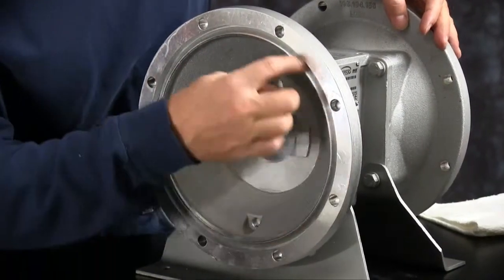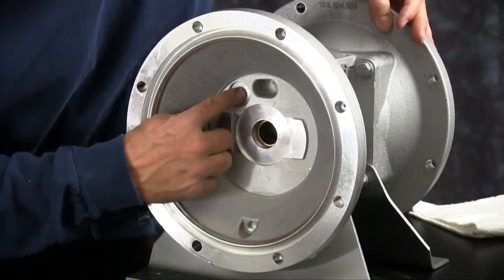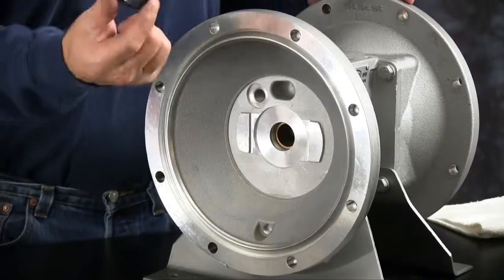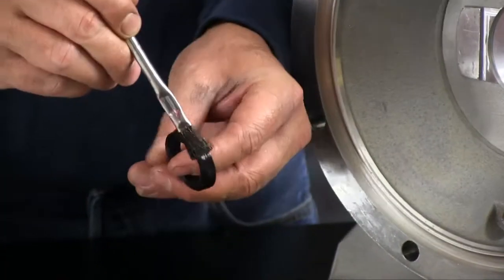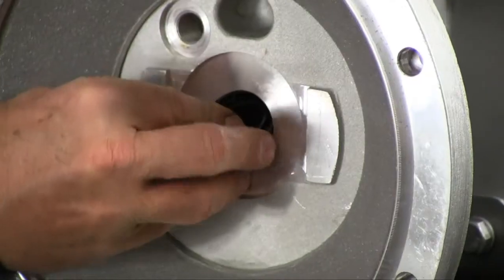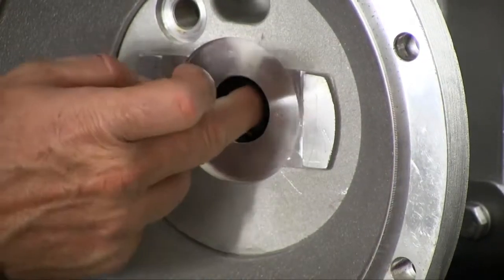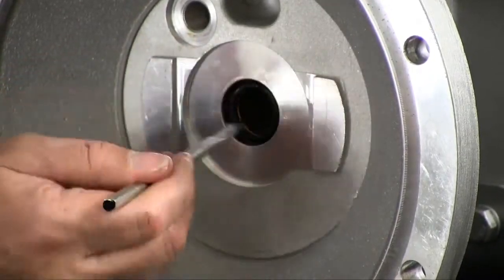You want to inspect the bead on the inner chamber, the faces on the inner chamber, and the bushing inside there before installing components. Make sure it's not oval. Take your new U-cup seal and apply a little grease to it. The open face of the U-cup goes out; the flat face goes in. You're going to have to work it into the receiver with your finger. Make sure it's securely seated, then apply a little grease. Repeat the same process on the opposite side.